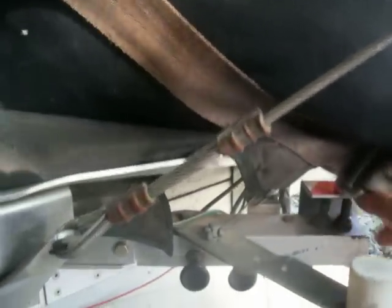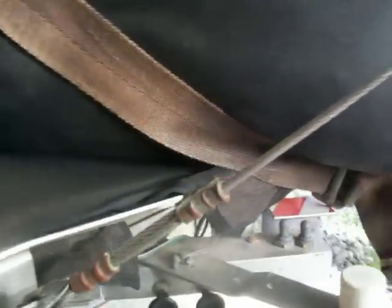You have your two ignition switches underneath there. Forward is on, back is off. When they're on, the throttle is idle. When it's 90 degrees out to the frame, it's idle. All the way back to the switches is idle. Then you push them underneath to shut it down. So it's kind of easy to shut down, so you've got to be careful you don't come back too fast on the throttle and hit the switches.